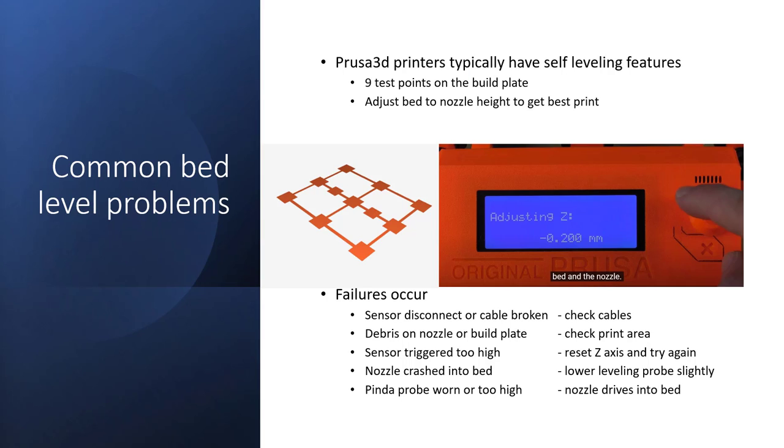There is a nine-point test you can do with a Prusa printer. You go into the settings and tell it to print a nine-point test, and it will do a grid pattern and print nine squares around the print bed. The idea is you want to look at it and see if every corner, every edge, and the middle are all printing appropriately. If not, I need to do an adjustment either on the print bed or on the Z-axis. There could be a slight gap at one corner — I might need to raise the left front corner — or a gap all around, meaning I need to change the Z alignment. I can go in and adjust the Z up and down as it's running, and as a default, so I can make on-the-fly adjustments.